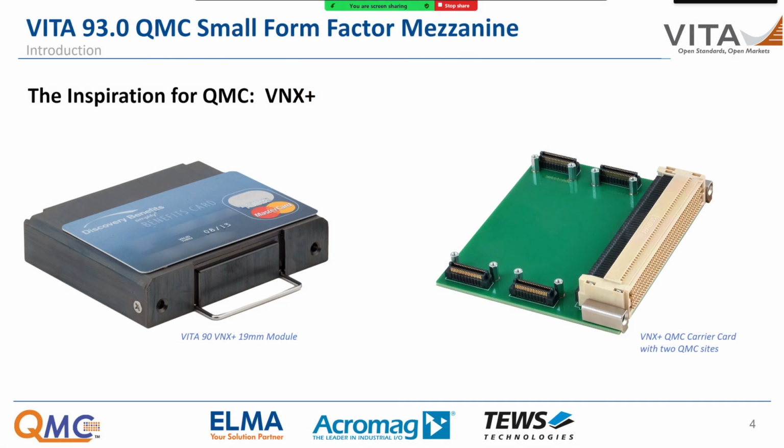So what is the inspiration for QMC? And I'm going to put this down because I don't want to be dropping things. The inspiration for QMC actually came out of VNX Plus. VNX Plus, or VITA 90, is a small form factor module. You see, quite small, but it's got a lot of the same capabilities as, say, an OpenVPX module might have. A very high-speed connector, data plane, control plane, expansion plane, and so on. What we needed was an I/O expansion capability.